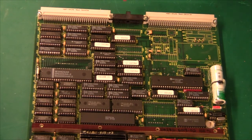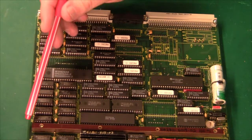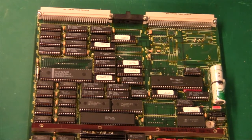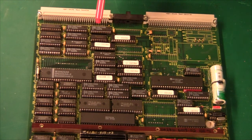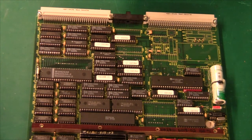On the left side of the second board we again have the 74HCT245s — bus isolation or bus drivers — and we have a lot of these. Then again we have a DRAM controller and we have additional DRAM here — another 512K. So if you include this board on the back plane together with the main board, you now have one megabyte of RAM, which was pretty good back in 1995 when this board was assembled.